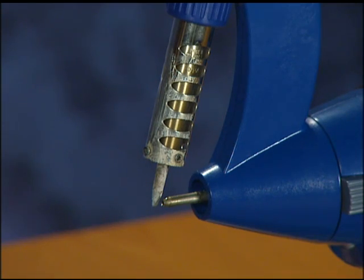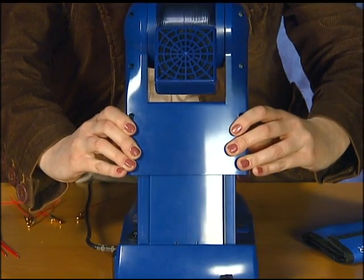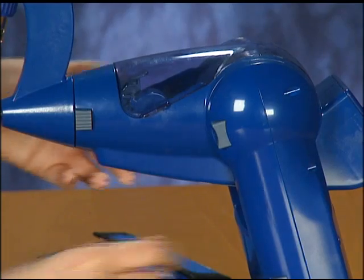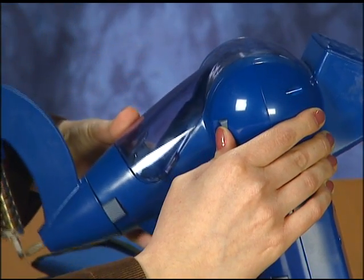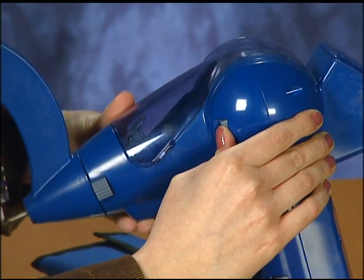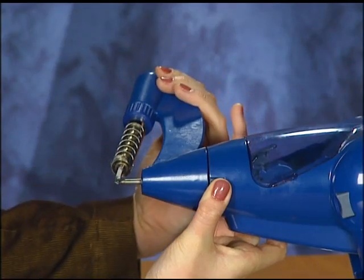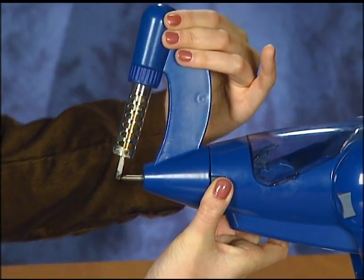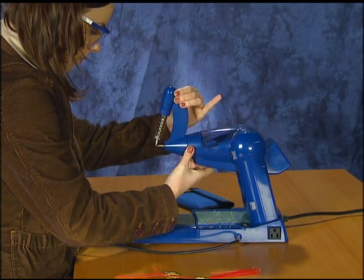The tip is held in place with the set screw. The adjustment range of 3 inches allows a tip height of 7 to 10 inches. The vertical adjustment moves the head from 15 degrees up to 45 degrees down. This allows the operator flexibility in the angle of approach. The head adjusts horizontally 54 degrees in either direction from the center. This allows the operator to set the unit in the most comfortable position.